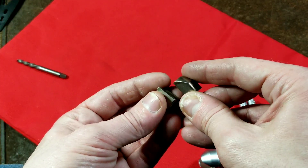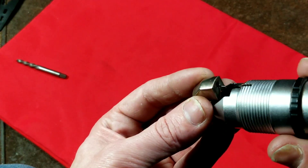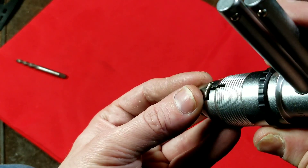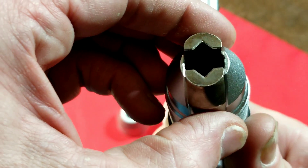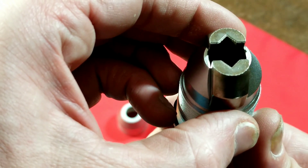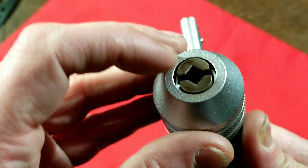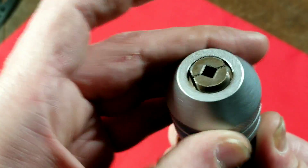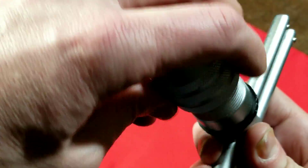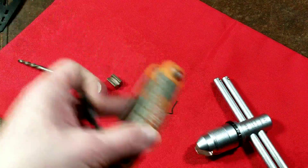This tool came pretty dry, so I'll probably add some lubricant — I haven't opened the ratchet mechanism yet but I will. You'll definitely want to lube this. It's probably easier to insert it upside down so you can get everything to balance. Then you put the collar back on. The frustration is that the spring will pop out, one jaw will sit higher, and it just won't close properly. That's the trick to reassembling it.